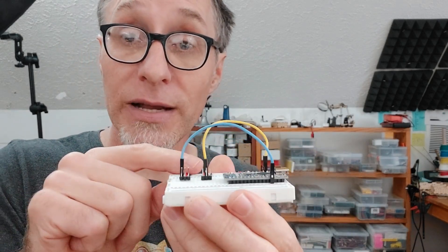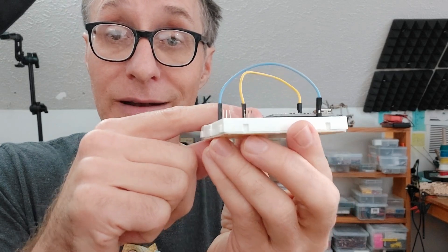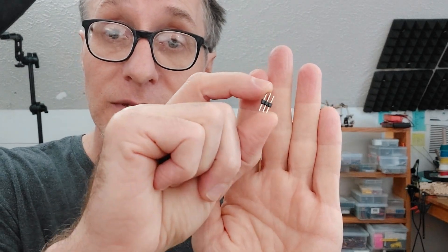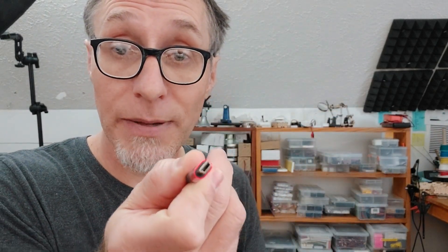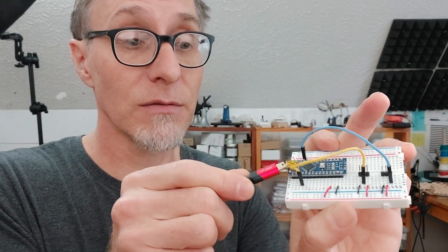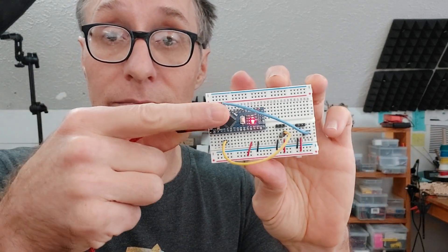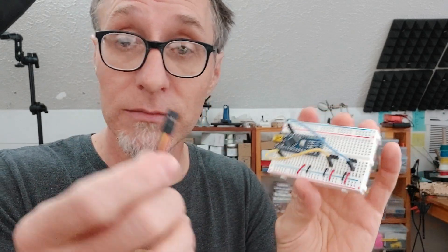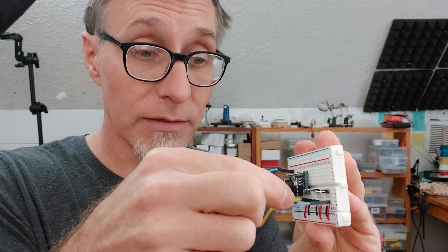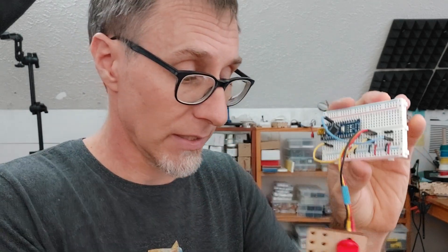On the other side, in order to plug in my knob and my servo, I've used a little three-pin header. You buy these headers in a strip and cut them to the size you need. They also make a version that's half-length on one side if you're going to use a board connection. I'm going to be using USB for power — just my regular five volt USB connection. I am not going to plug anything in while the board is on. Do not plug things in while your board has power — turn off the power, then plug things in.